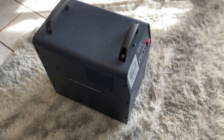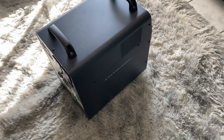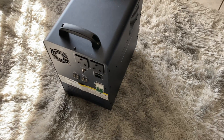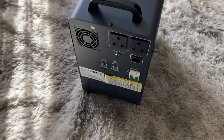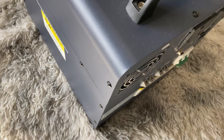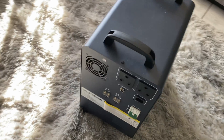This one has a one kilowatt hour system. If you have a TV that uses a hundred watts of power, this will power it for 10 hours. Electronic devices will be fine, but things like drills and high power demand devices are not recommended — it will beep. If you try to connect a hair dryer or an air fryer that uses a lot of heat and power, this will beep.